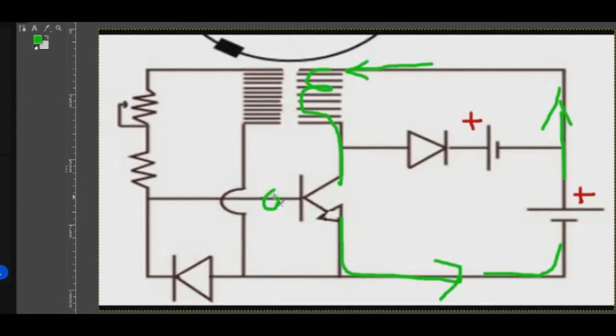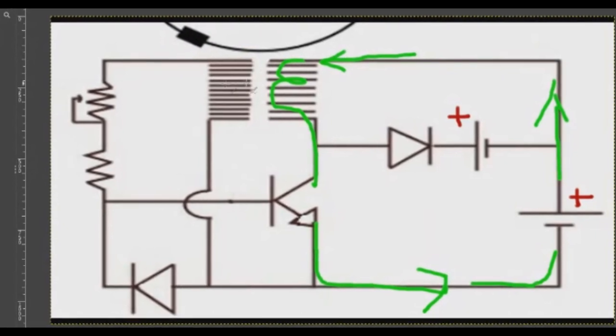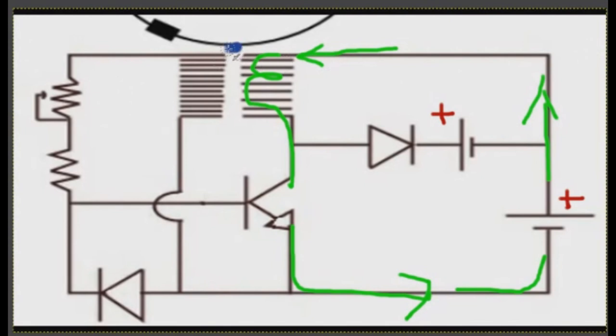You trigger the transistor at the base using a magnet. There's a spinning magnet on a wheel, evenly spaced, and when it lands over an iron core — there's supposed to be a core here — these two coils are wrapped together bifilar. It's 26-gauge wire for the main winding and 28-gauge for the trigger, about 150 feet of each wire twisted together, wrapped around a bobbin with a core inside.